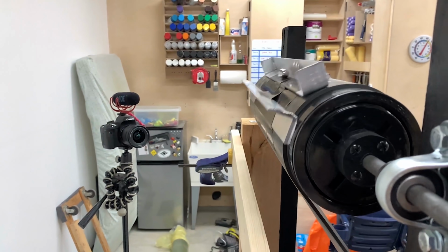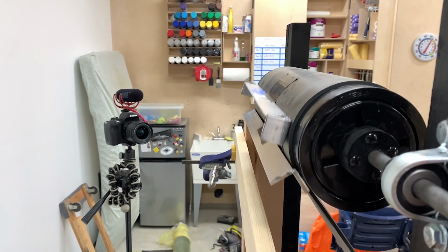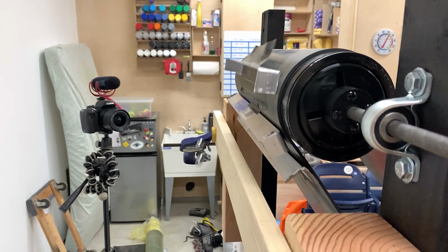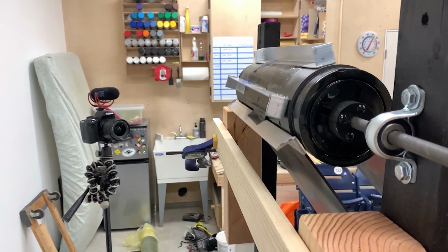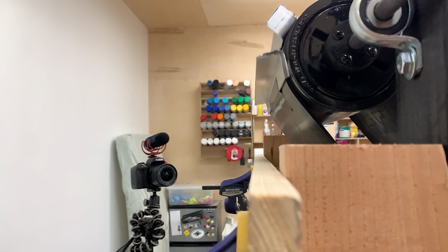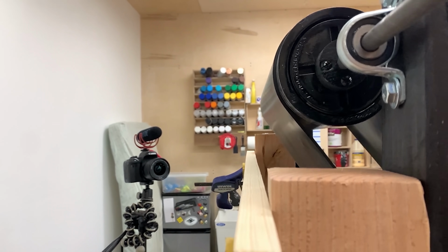Now, one thing I needed to lock in is the spacing of the brackets. 2 inches is just a starting point. I ran some tests at the top, and at 2 inches, the marbles bopped the bracket ahead on the way off the lift. I ran more tests, increasing the gap a quarter inch at a time. And at 2 3/4 inches, there was finally a big enough gap to not have that collision.